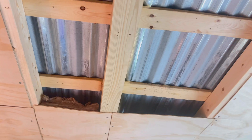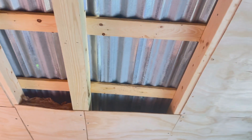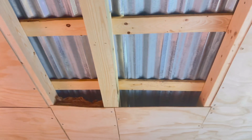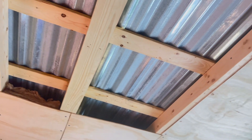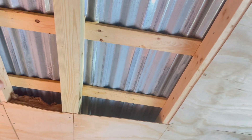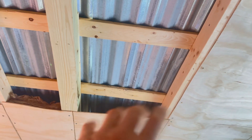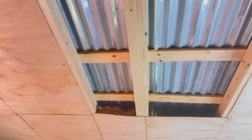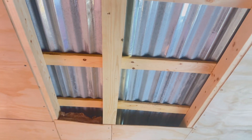I finally buckled down and did some research. A tin roof — when you're installing it, let's break this down — there's going to be only a couple of different solutions to a tin roof not sweating. One is to spray foam. If you've already installed the tin roof, you get a professional spray foam and spray foam every little thing. That gets to be a little costly because you're not just talking about the foam, it's the gear. You have to dress up and cover all your stuff. I'm not doing that.